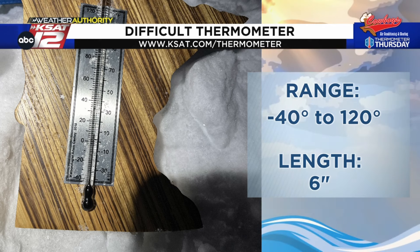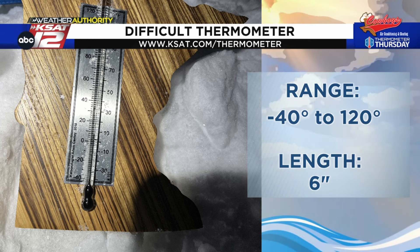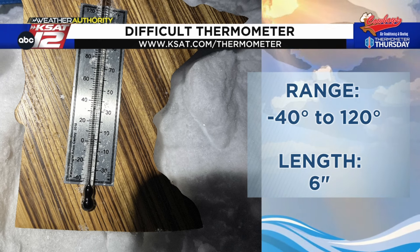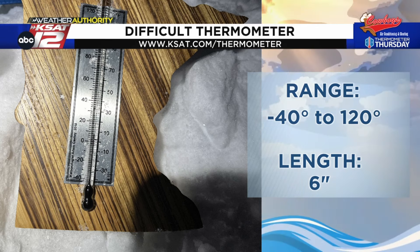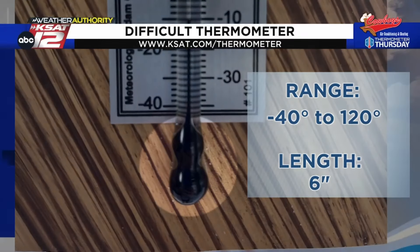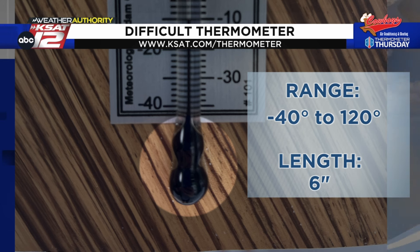You've got to travel with thermometers and see what the conditions are. The range of it is minus 40 to 120 — no big deal — but I have to get that kind of range within a six-inch tube of glass. I have six inches to work with, and I have to meet that big range because that covers all the possibilities and then some in Northern Minnesota. This comes down to getting the bulb the exact perfect size to meet that range within a six-inch thermometer.